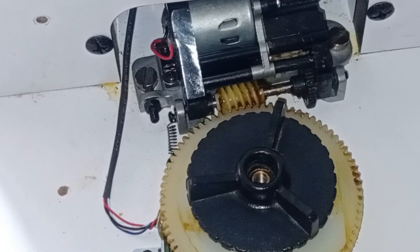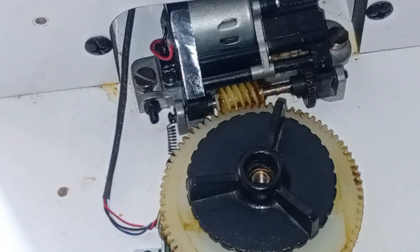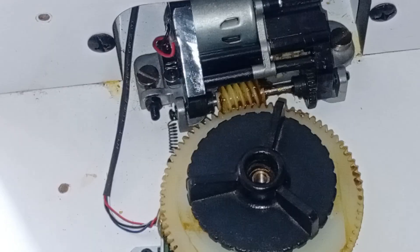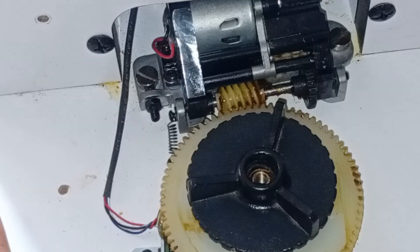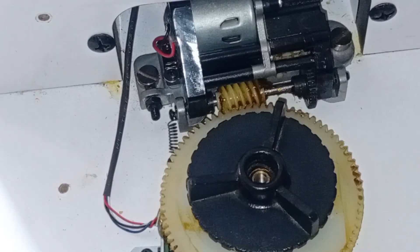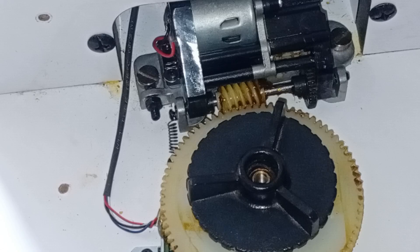Install the wheel and tighten it, and as you can see there is play. To be honest I don't expect it from SkyWatcher that they did this. Maybe it loosened itself, or more likely SkyWatcher didn't expect this to be used for deep space — they expected it to be used for planets, and for planets the backlash doesn't matter.